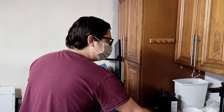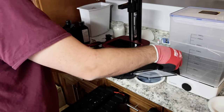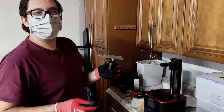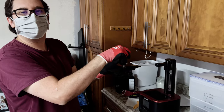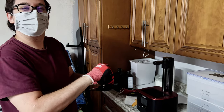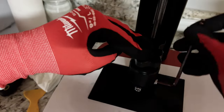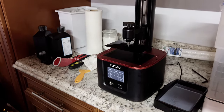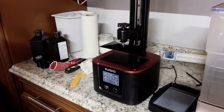So it can be many things and I am still learning. So because the last print failed, I'm just going to loosen these screws that are keeping this still, and then re-level the platform to make sure it being not level isn't the reason that the print failed. It's also very important to print in a well-ventilated area, which is why we're in the garage where I have an air filter running and we have some vents in the wall.